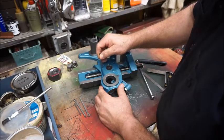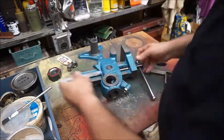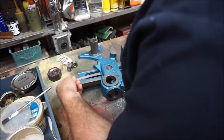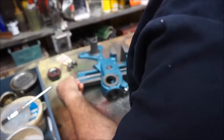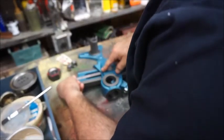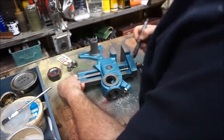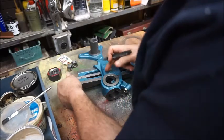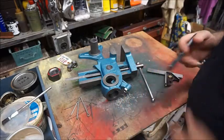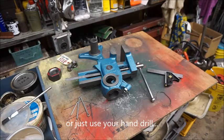The cotter pins will capture the nut both at the top and at the bottom, above and below the screw. It appears that my nut has about 550 thousandths clearance before it reaches the edge of the casting. So I figure if I go in about half an inch from the edge of the casting I should be okay to drill holes approximately above and below the screw. I'm off to the milling machine to do that and I'll be back when I'm done.